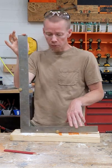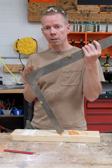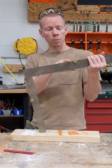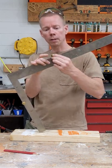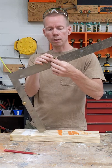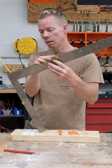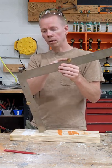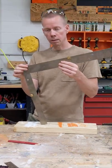But it's also used to make steps. I'll demonstrate how you use it for steps in another video, but what it does is it gives you your rise over your run, and you use these little tiny clamps called gauge clamps to put on here. So if my run was 10 and a quarter, on this as a ruler all the way across I'd set this 10 and a quarter, and if my rise was 7 and a quarter I'd put it here. It allows you to put it right on to your stringer and draw all the lines and then cut it out.